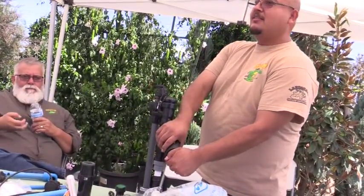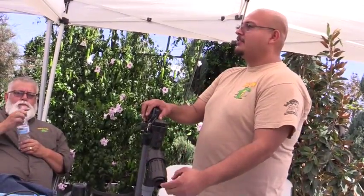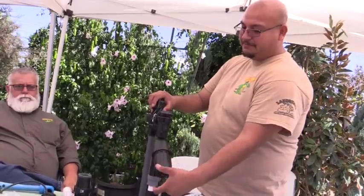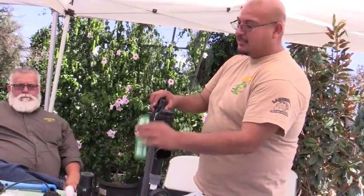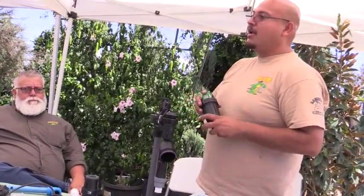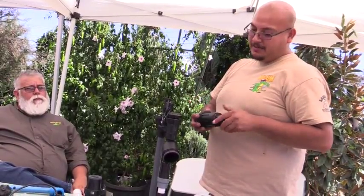These filters are really easy to service. You can just open this cap, turn it on, and it'll flush out whatever's inside. Or if you want to go a step further, you can just unscrew this cap — they all have these nice little filter elements. These are replaceable, and they keep out any sediment that comes in the water line. A lot of times bugs like to crawl into these anti-siphon caps, so the filter keeps it from going down and clogging your emitters.